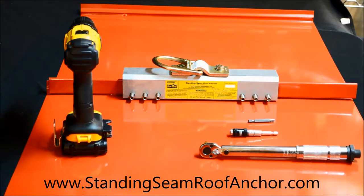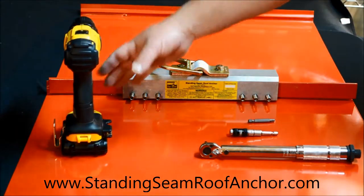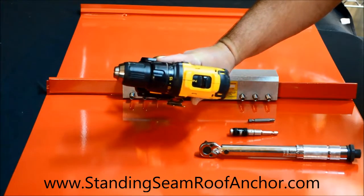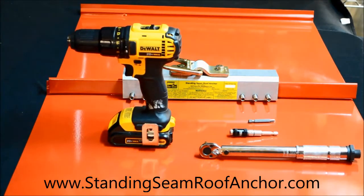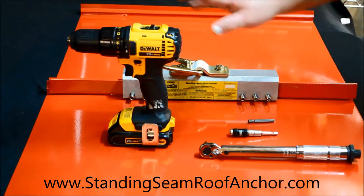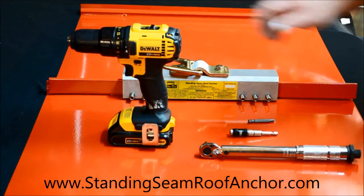So basically, once we have it in place, it's about a 2-minute installation once we start going through setting, snugging up the first step. One is we're going to snug up these six set screws with the screw gun. I know on my personal screw gun with this clutch that with it set on the highest clutch rating of 15, I know that still puts me actually at about 75 or 80 inch pounds. So we're going to be torquing these cup tip set screws today to 90 inch pounds. So I know I can be on a setting of 15. Your gun's going to be a little bit different.